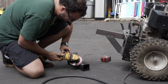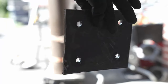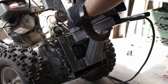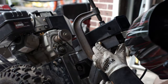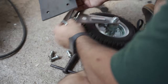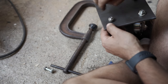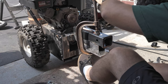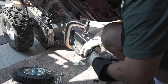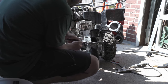In between cleaning off the trailer hitch receiver, I took a piece of scrap plate and drilled four holes in it to mount the caster wheel to the body of the snowblower. With that out of the way, I welded the receiver to the top of the square tubing, making sure to focus a lot of the heat into the receiver because it was a lot thicker than the tubing below. I then clamped and welded the plate to the bottom of the square tubing on the snowblower, bolted the caster wheel on, and checked out how it worked.